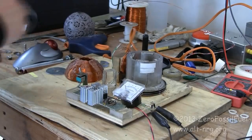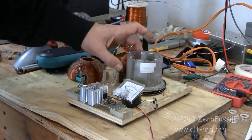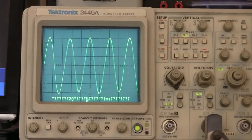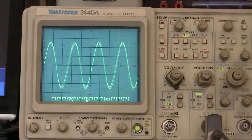Now when this wheel is spinning, the voltage induced in this four-layer coil is approximately 15 volts peak-to-peak, or 7.5 volts peak, roughly 4.5 to 5 volts RMS.